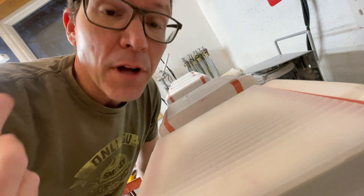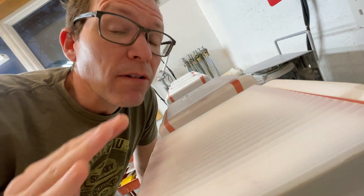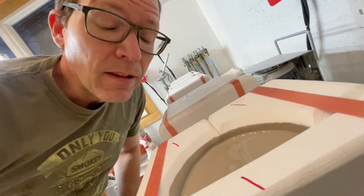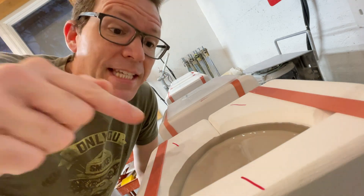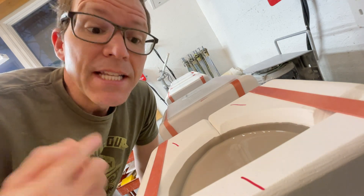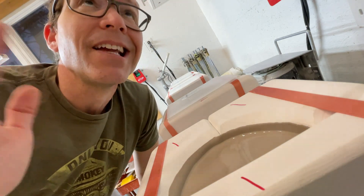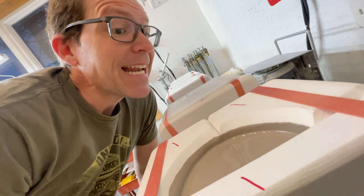This well is another unknown with the new mold. The plastic bits on top are to keep the slip from skinning over — when air comes in contact with slip, it will get a skin on it, and this keeps that from happening. The unknown is whether the well will be big enough. At the top of these molds you have a well that compensates for the dropping level of slip as the walls build up on the inside. Hopefully this well is large enough that I don't have to keep adding slip throughout the 55 minutes of dwell time. Every 15 minutes I'm going to come check the slip level — it's fallen about just shy of a quarter inch in the first 15 minutes, so I think we're going to be fine.